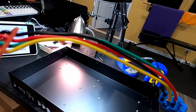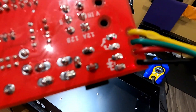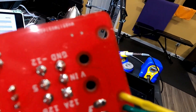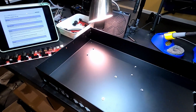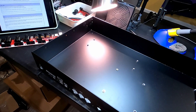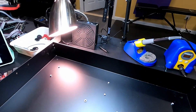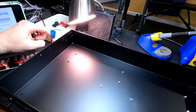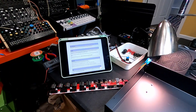I got the power switch wire done — you loop it through the holes underneath and solder it on the bottom. Be careful not to touch the insulation with your soldering iron like I did unfortunately — it didn't totally melt it though. So next up is assembling the case: you start with the rubber feet and the power switch, then put the boards in, then the rails. The boards hook together with a Molex cable. The power switch is really cool — a funky connection I've never seen before.